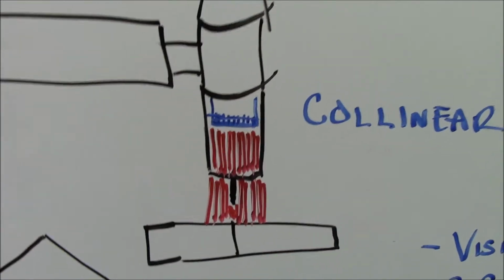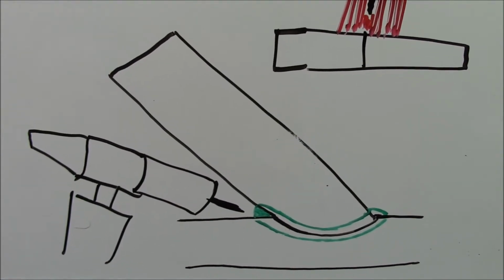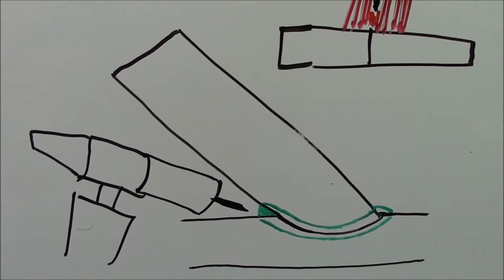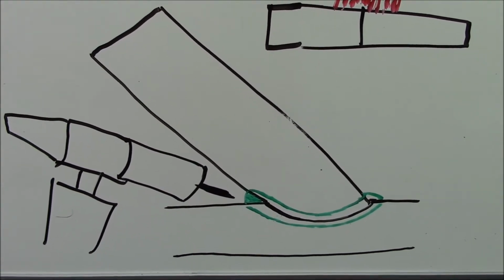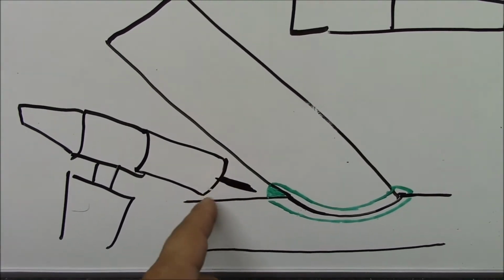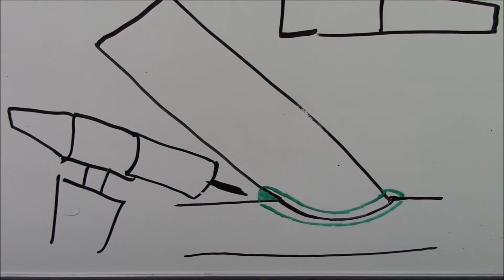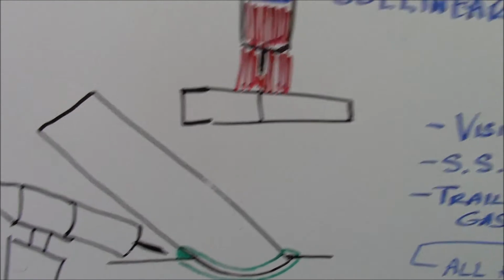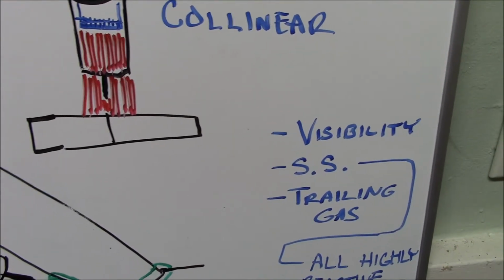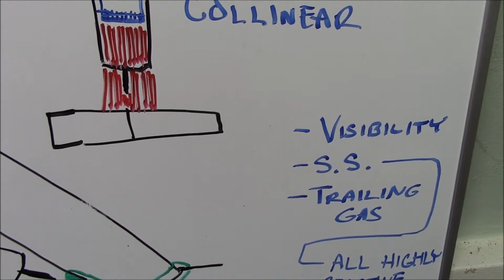One of the big places that helps out is when you get into welding some frames, Baja frames, tubing joints, TKY connections, stuff like this, where you need that extra extension in your electrode, because otherwise your gas cup is going to interfere with your work. So a few other things the gas lens will provide you is, with the additional stick out of the tungsten electrode, you're going to have a lot better visibility of what's going on.